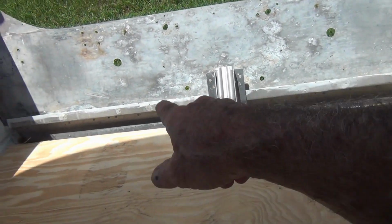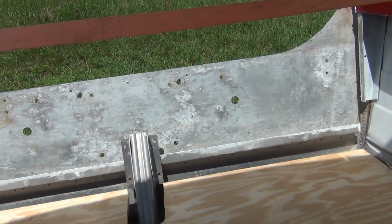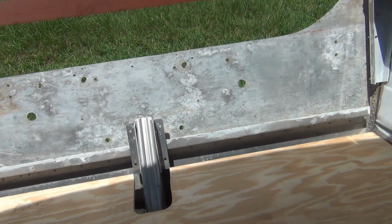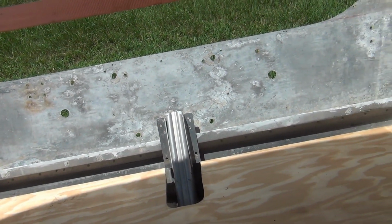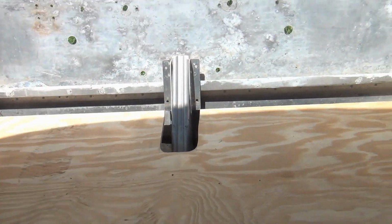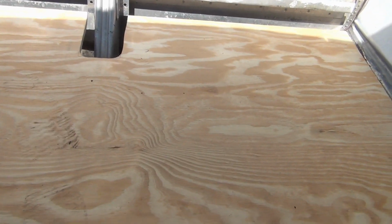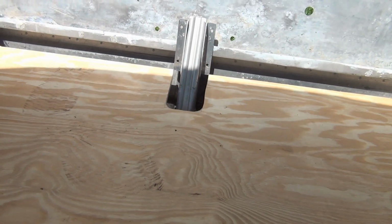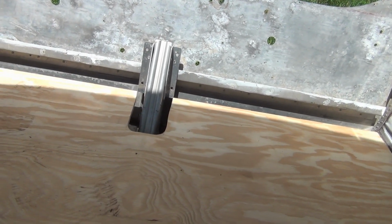So I'm in the trough here, whatever you call that piece, and I should be good. I want to keep it open. If water gets in there, I don't want it sitting in there. I want the air to get in there so it can dry. The back of that transom board and the sides and the top and the bottom are all resined up, so I don't need tons of sealant. I have to mark my stringers down there, because I'm going to cut that out from one stringer to the other so it's open and water can drain. I'm not putting this thing in the water before that splash well is ready, so anything coming in has to go out fast.